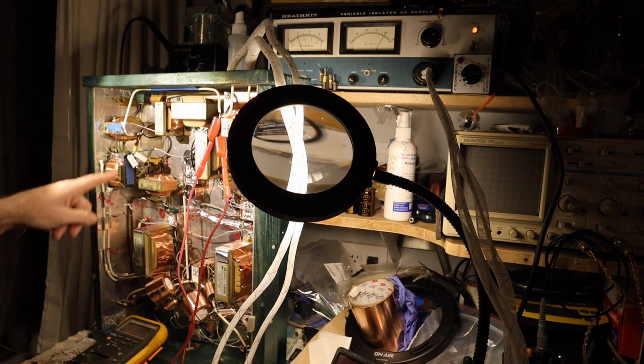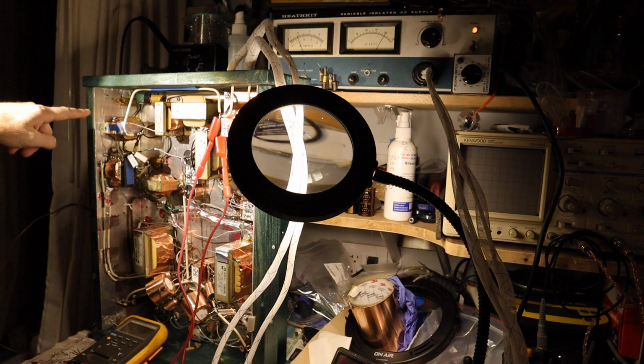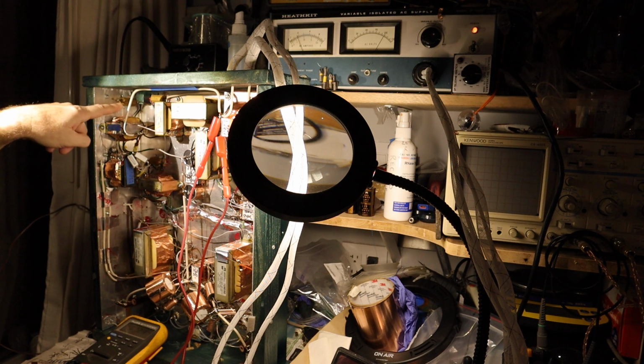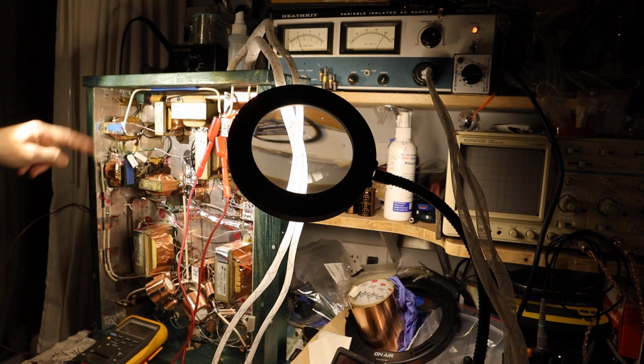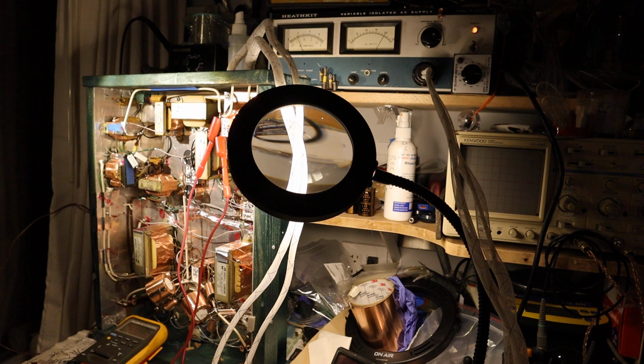And you can do that either through there, or you can also do that by checking that extra resistor that I have in the Darling schematics, which is a 100 ohm resistor that I suggest. And on that one, the voltage drops on the primary side. So there the calculations are a little bit more complicated, because the current there is for the primary windings, which is not the same as the current on the secondary. So anyway, that's a topic for another day, how to calculate that.